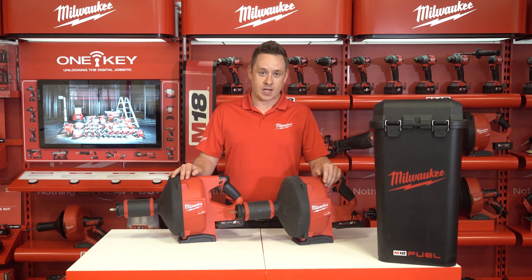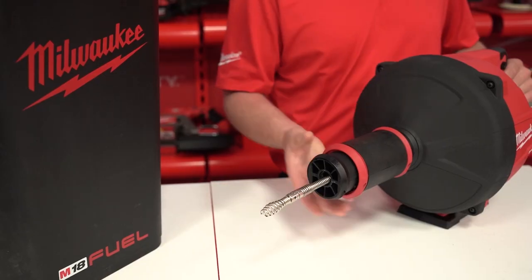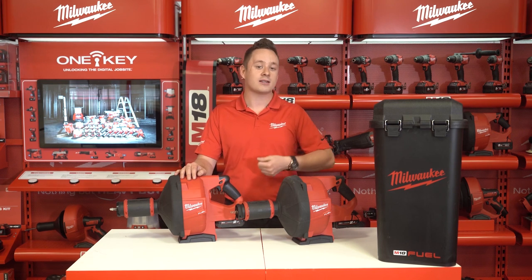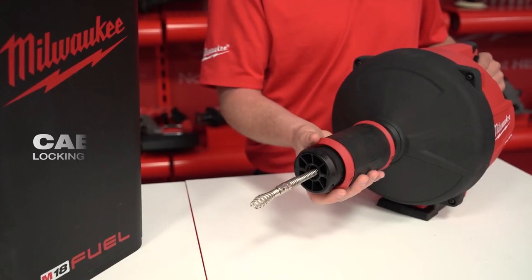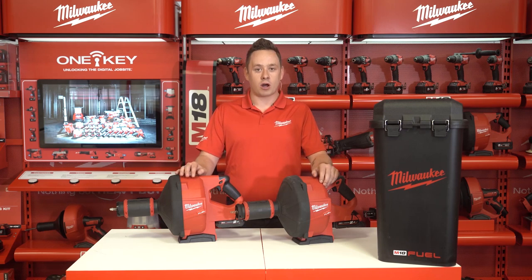The third feature is the cable drive system. Milwaukee has incorporated a cable drive system that automatically feeds and retracts the cable with three positions located at the front of the tool. It's very simple to use. Position number one is neutral — leaving the cable drive in neutral allows the user to feed or retract the cable by hand. This is beneficial especially for feeding the first part into the drain before activating the tool. Position two is locked. We take the grip at the front, slide it backwards, twist it to the right and now the cable is locked. This means that the cable will not feed or retract in or out of the drain.